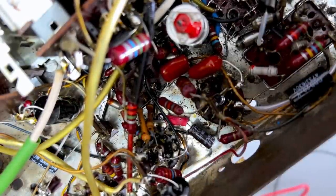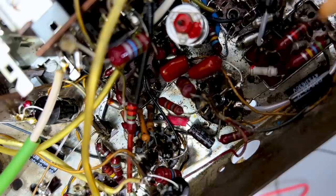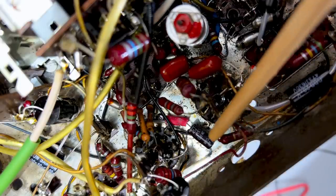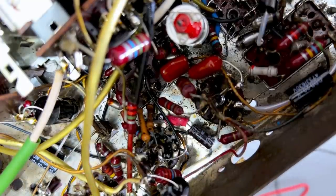I've said before that there's usually method to my madness, and this again applies to the reason why I do this in the order that I do — in other words, power supply, amplifier, AM bands, and then FM. The reason is that once you've done all that, once you've replaced all the capacitors related to all those circuits, really the only one that's outstanding is this guy over here, which I've already replaced. It's the discriminator capacitor, 4.7 microfarads — the circuit calls for 5 microfarads, so that's fine.